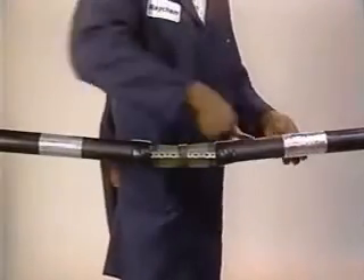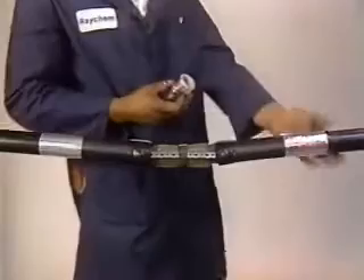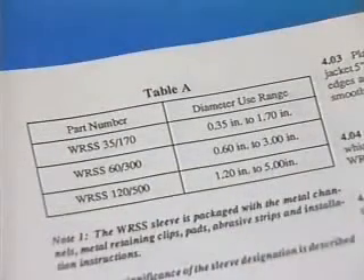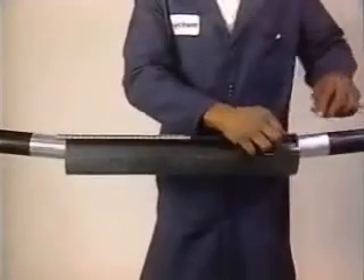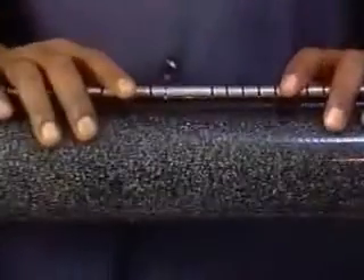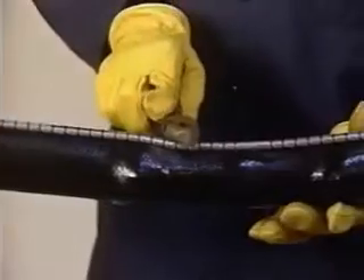After cleaning and abrading, place four-inch aluminum tape as previously demonstrated. Then measure the prepared area for minimum and maximum diameter, select the proper size WRSS sleeve, cut the sleeve and channel to size, flame brush the cable sheath, and assemble the sleeve, making sure that the channel is 90 degrees or more out from the bond bar. The sleeve may now be recovered and cooled as already demonstrated.